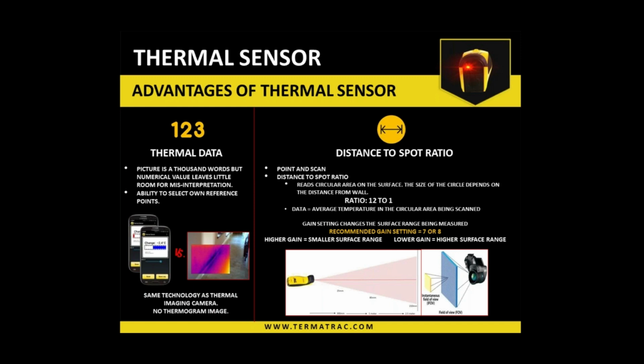But the moisture and/or thermal just gives you a bit quicker way of locating any specific anomalies, which then gives you a target point. Okay. Yeah. That would be my sort of suggestion in that sense. But by all means, if you have common areas where they always are, due to whatever factor or reason, definitely use the radar only in that area. There's no harm in that. It's just that you can't do the whole building or the whole room. It'll just physically take too long.